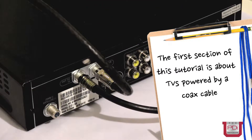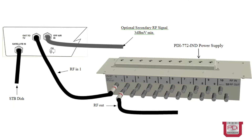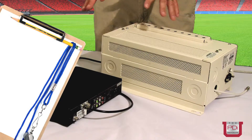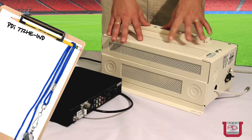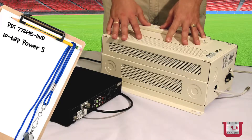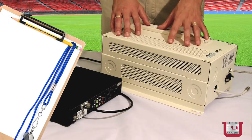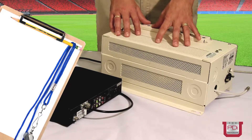The D12 is used commonly because it's economical and it has an amplified RF output that can be home-run to the television. I want to talk about the most simple form of wiring at the head end. We'll show the equipment here on the table. This is the PDI 772 HE 10-tap power supply — for every 10 arm-mounted televisions you'll have one of these in the head end.